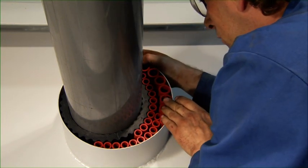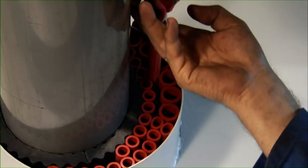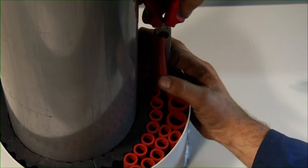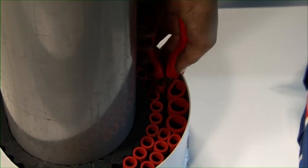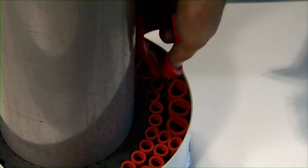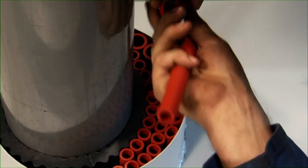To provide sufficient stability and fire safety, the optimum ratio should be about 1 to 2. To obtain the required mechanical stability, the complete set of filler sleeves must fit tightly in the conduit.